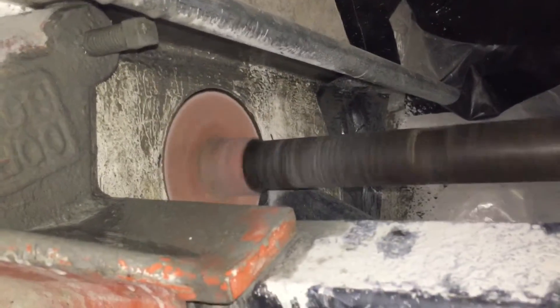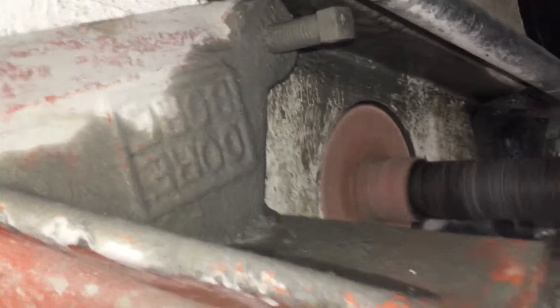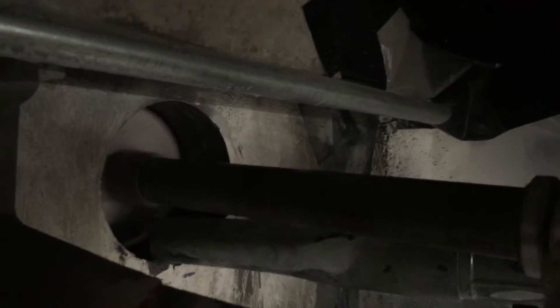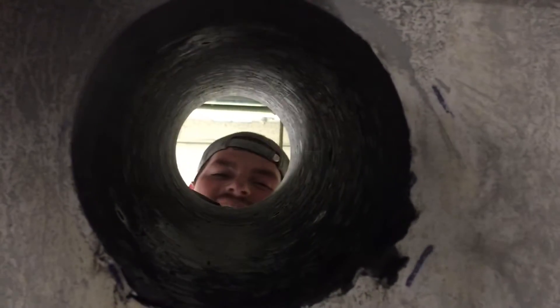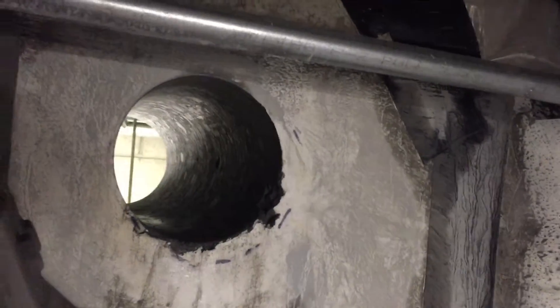Things went really smooth. We did a lot of preparation making sure the stand and coring head were exactly straight with the wall to the left, so we weren't going to drift left or right — that way you come out exactly where you want. Here we are, finished the last six inches. There's Pat on the other side checking things out — a nice clean core.